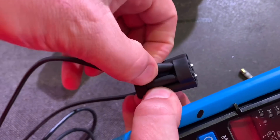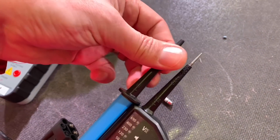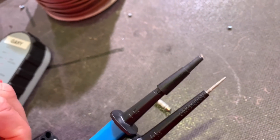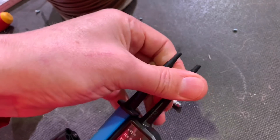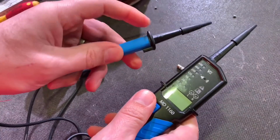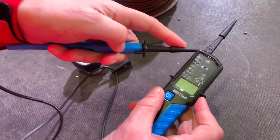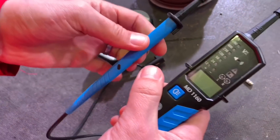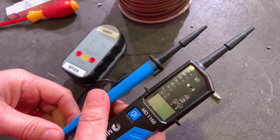This also comes with — again this is the GS38 part — shrouds that go on the tips. They reduce the length of the exposed part of the tip, so you don't want to short circuit your probes together, and you don't want access to the probe when it's touching live parts. Also the probes themselves have finger guards — they slip down there so you can't touch the probe ends — and shaped grips as well. Lots of things that come up in GS38; remember that's downloadable in the description.